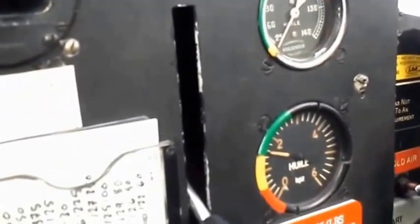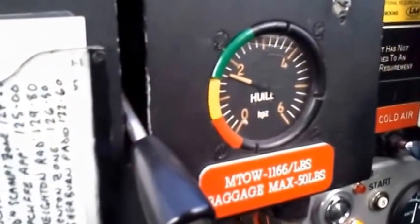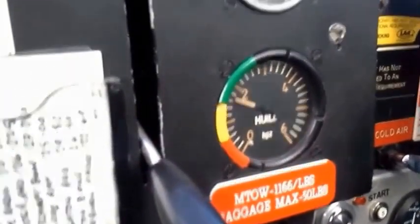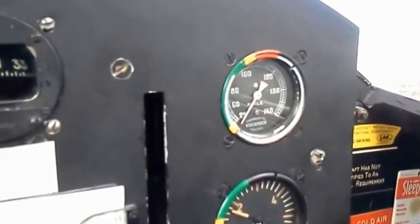Little incident there, it needed more fuel. I'm just going to tap the throttle, just with the rest slightly, not too much, because we want to make sure that the oil pressure is coming up to the working pressure, which it is, should be around about 2 bar or just less than 2 bar. And of course the oil temperature is low now.